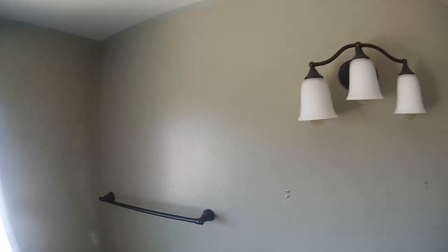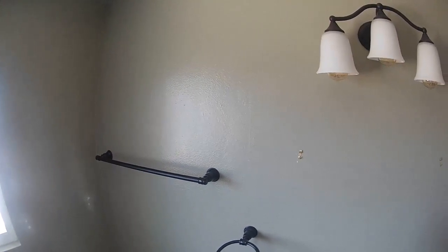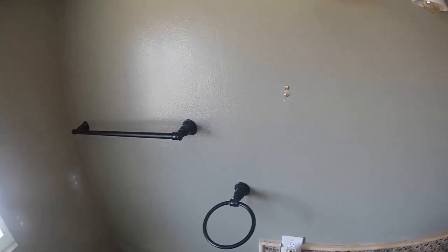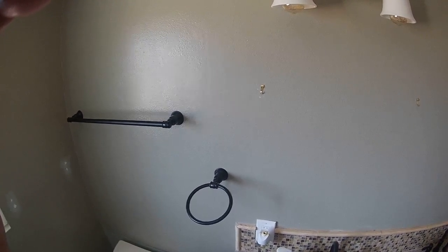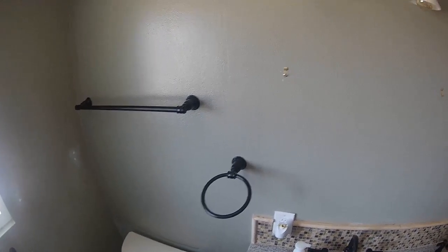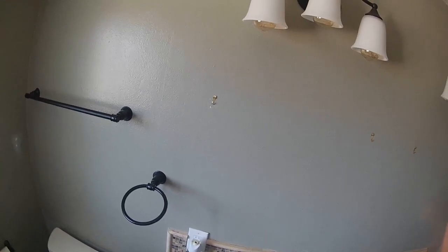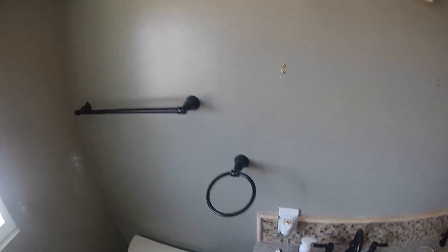Ask yourself: what are we painting? Walls. Why would I use a sash tool to paint walls? This is what everybody does — they think they need an angled brush to paint walls. That's actually not what's on the label of any of these brushes. Somebody who knew what they were doing made these brushes with the right names, but people without journeyman experience adapted the wrong ways.